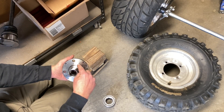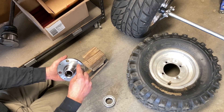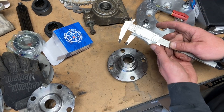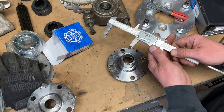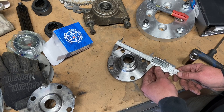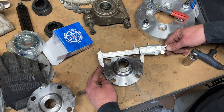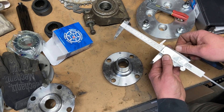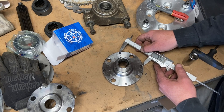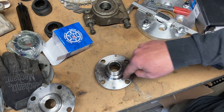I wasn't too worried about centering this exactly — there's plenty of meat between the holes to get it in there. I know you're thinking it's going to blow through the other side, but we're using smaller M10 bolts instead of M12, so this actually works out. Now I'm going to take my caliper, run this out to 110 millimeters, make sure it stays zeroed, and verify center to center. I'll go across and measure it center to center to make sure it's logical, then set this to 77 millimeters and make sure those distances match. They are all perfect. Now I'll take extra time and get the punch exactly where I want it so the drilling works out great.